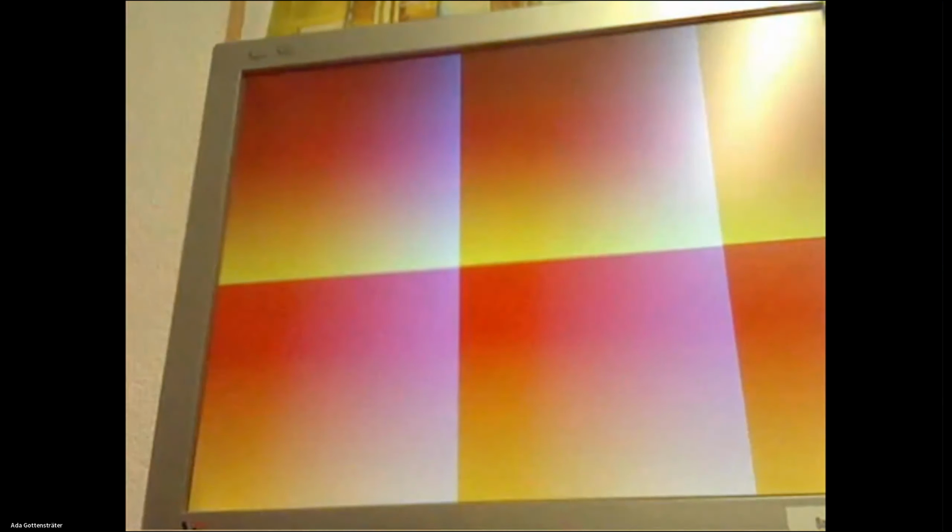Yeah, it's hard to create an unstable display, quite honestly. Well, I say that, if you do funny stuff, of course. It's a very tolerant spec, if you understand that. No, it's just very easy to get right, if you don't do anything funky like change timing midway through. I had an issue with one of the emulator drivers because it has to emulate interlacing on the VGA screens by sort of shifting the picture down a bit, and it was reading that flag mid-frame, and when it changed mid-frame, there was a line missing from the VGA signal, so it kind of lost sync on some monitors. But now it doesn't anymore. I fixed that.